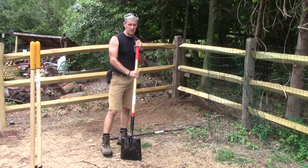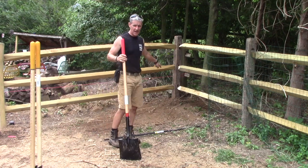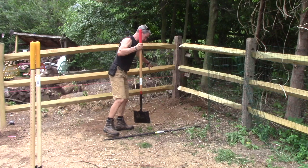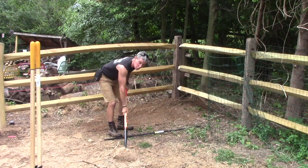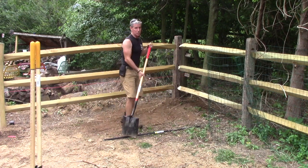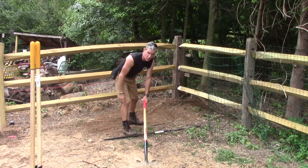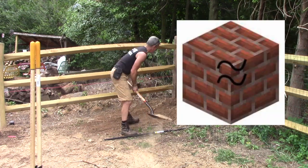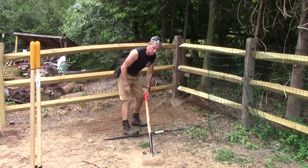It's spitting rain here on the split rail fence project. I had two holes open with my dirt piles out here. And if you have clay-like soils where you live, like I do, and it's about ready to get wet, tip to you: stop what you're doing and get those holes filled in, because clay plus water equals brick. Not really brick, but it makes the dirt way hard to handle on refill. Get it while it's dry.